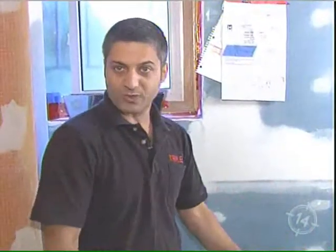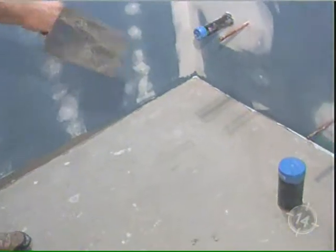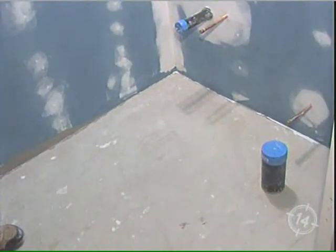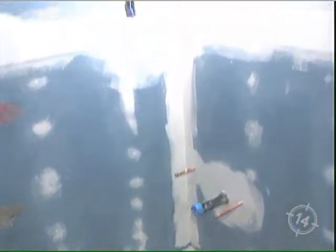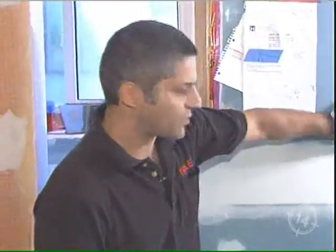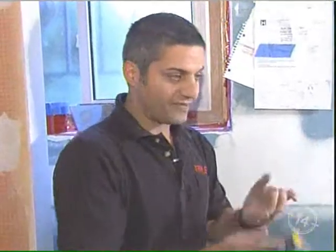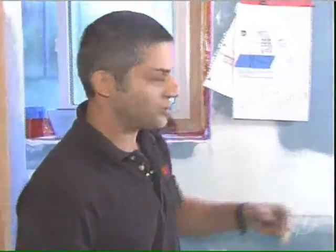They've been here to inspect the sewer rough-in. This entire floor was excavated. If you zoom in and highlight some of the rough-ins here — the one with the blue cap, that's a three-inch brand new line that was run in for the toilet. The other one for the sink, and the copper for the water supply. The City of Hamilton came, they inspected, they approved. The next visit was to inspect prior to the drywall going up. This is an outside wall, so we have the potential for hot meets cold, and the City came to make sure I did my job properly — proper vapor barrier, proper taping of all the joints and seams.